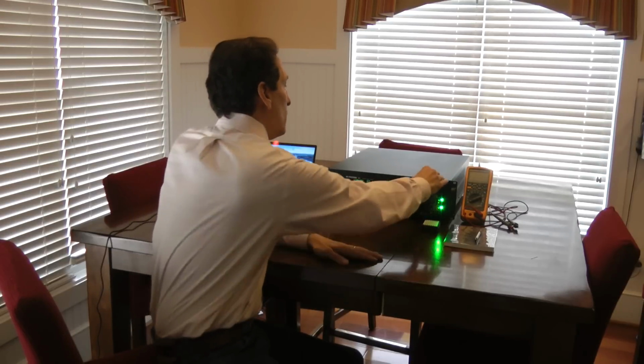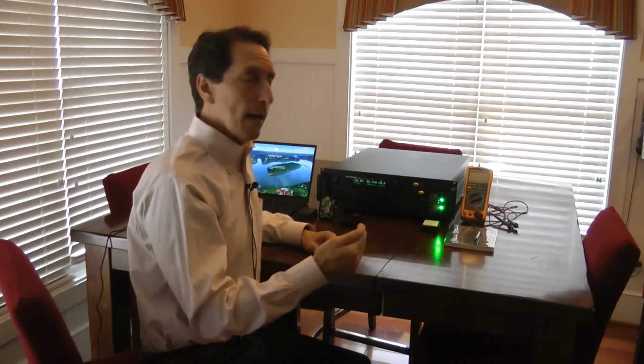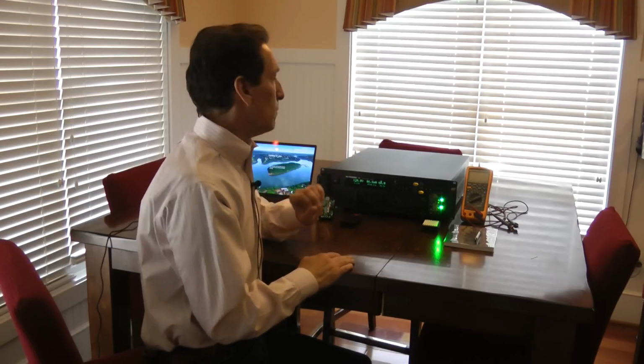Those levels are completely settable by the values you put inside here. So if I want to dial up the voltage, I can go over and dial it up. We don't want it to sound every time the voltage goes up or down a few volts, because you'd be constantly wondering if an EMP is happening. But we do want it to sound when the voltage levels get abnormally high. I arbitrarily set this to something like 160 volts. Again, that number can change very easily, and we'll have the right numbers in the final production units.